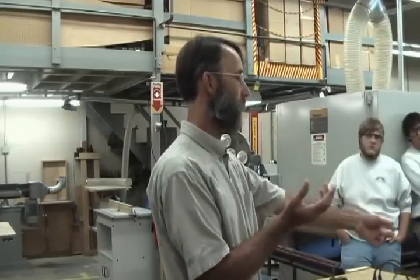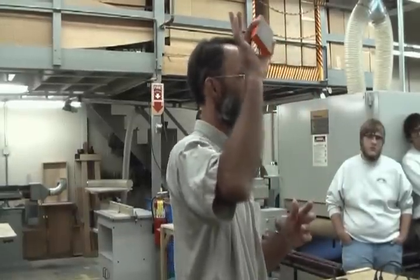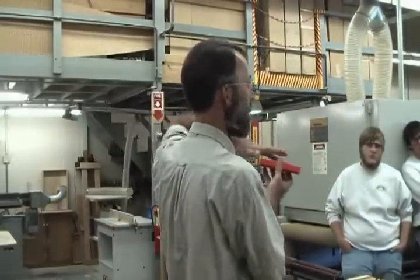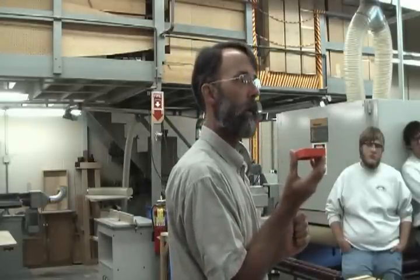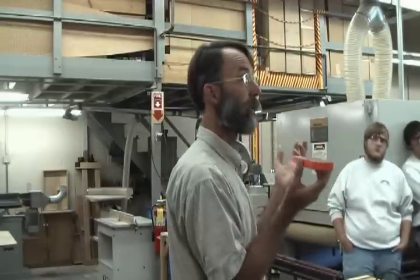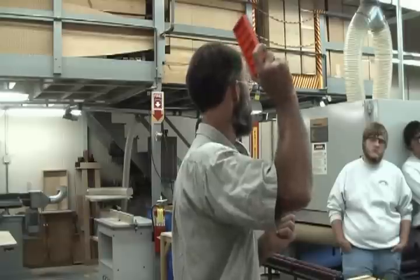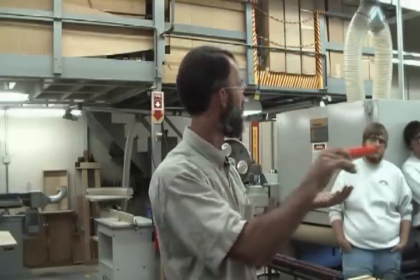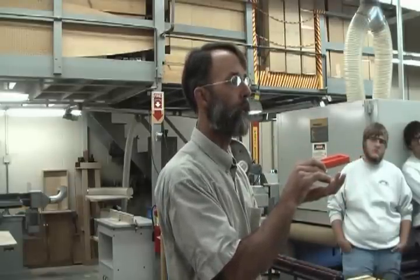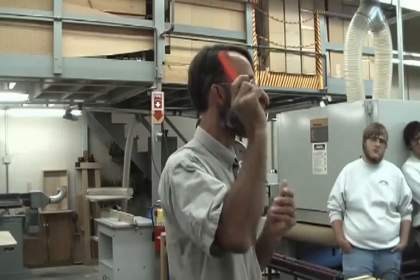That box lot you got at the auction with the grindstones in it, maybe it's got a couple other stones in it. They might look like this shape, but they're stone, they're gray. They're sort of bellied in the middle, if somebody's been working their chisel down the center forever and never evenly wore it off. Some of the better stones, they use them for knives, they call them Arkansas stones. Good stuff. But even a stone that has that belly in it, you can use, and you could take something like this diamond stone and water and flatten out a regular grindstone. You can redress a grindstone, so you can save them. The diamonds are nice though. You get some jobs and you get some quality tools. Diamonds are excellent.